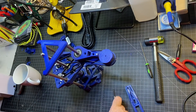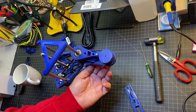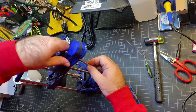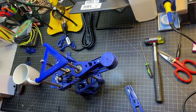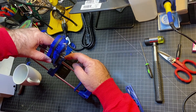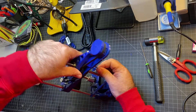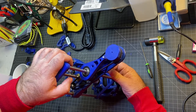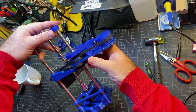You might even have to reprint these, because when this part's over-extruded there's not a whole lot you can do. So those are in, and then you're going to take a 15mm screw — there's two holes on the bottom — and then you're just going to tighten them up. You should be able to draw that nut down when you're tightening it. Don't overturn it either, because you don't want to strip that plastic. Insert the screw, start twisting, you can see it catching the nut, then just keep turning it until the nut drops or draws down. Once it's nice and tight, don't overturn it.